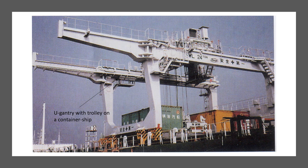Now I'll talk about the U-gantry with a cable trolley without a fixed jib — you can see it in the picture on screen. The forces in a crane are distributed more equally in gantry cranes with two beams compared to one beam. If a gantry crane has two beams and a cable trolley without a jib, the forces are more evenly distributed compared to a crane with a fixed or rotating jib, which experiences greater torsional forces.